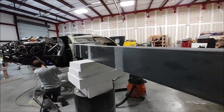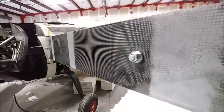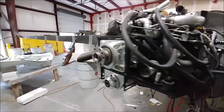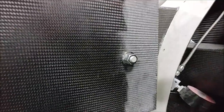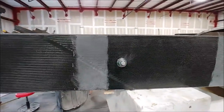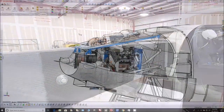You can see both wing spars fully bolted on now — that's just temporary hardware; we're going to have locking nuts on there. It's sitting back up on the foam on the spars just because I was working on those drilling those landing gear bolts, but that's been done now. So that can come off shortly and we can actually start constructing that wing.